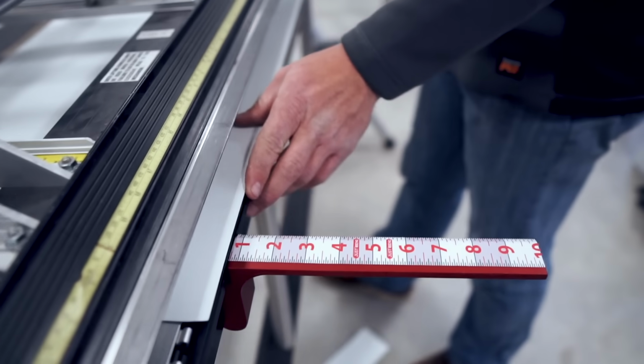All right, so the next trim I'm gonna show you is a very simple trim. It's a ridge cap trim. And obviously you're not gonna use it on a shingle probably, but if you're doing any metal work and you wanna bend your ridge cap, you're gonna watch and notice that almost every one of these trims, once again, is gonna start with a 3/4 hem. So we're gonna do that. I'm just gonna put my material on the edge.